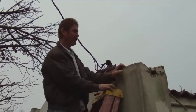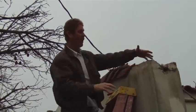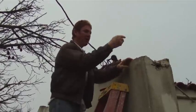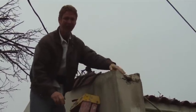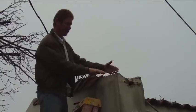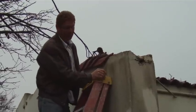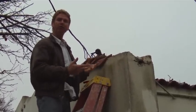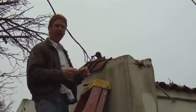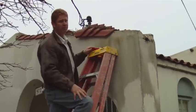Driving home I thought: I can put a piece of grace membrane over here, put some wire, put some cement, give it a little arch, and then it can be painted — that way water won't sit on it. When we get to that stage, I'll show you there's nothing down in here. This whole wall is supported only by stucco. There is no wood left. It's an outside wall, it's deteriorated — there's nothing left.